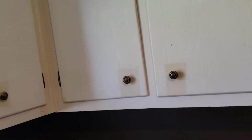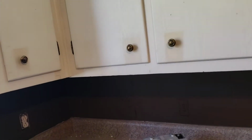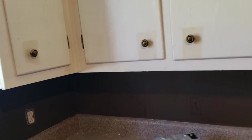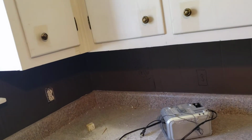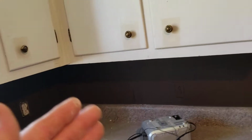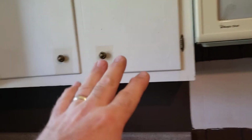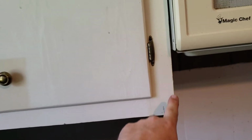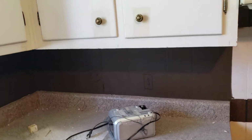Now, that gives us a 3-inch reveal to the inside. Your 15-inch cabinet will still go on that without any problems, if the doors are standard overlay. Now, if they're full overlay, we need to pull that to 33, okay? Because it's a 15-inch door that I'm working with. And if we pull it to 33, this will be a 15-inch cabinet instead of an 18-inch cabinet. But overall, right now, the cabinets come to 49 inches. We're going to step back to 48 inches and work this all off of a 48-inch corner.